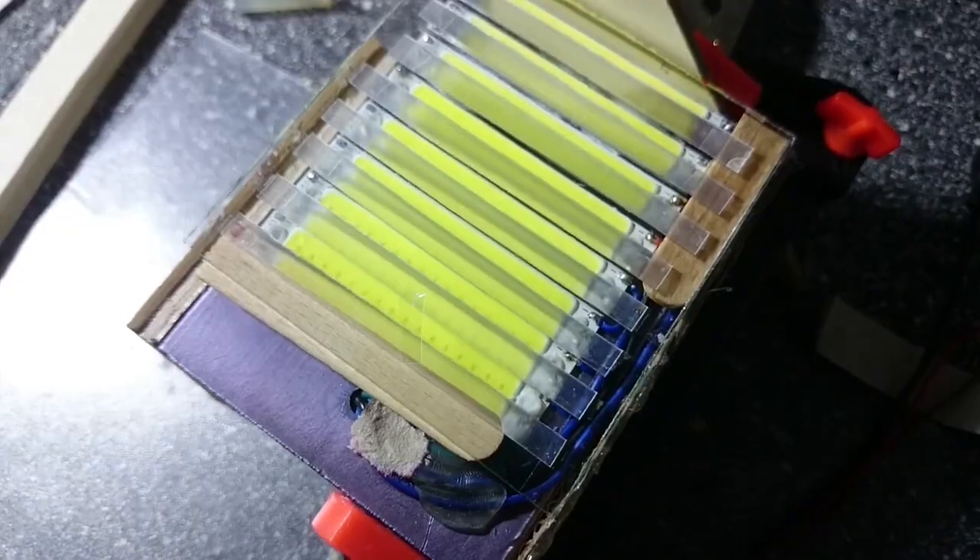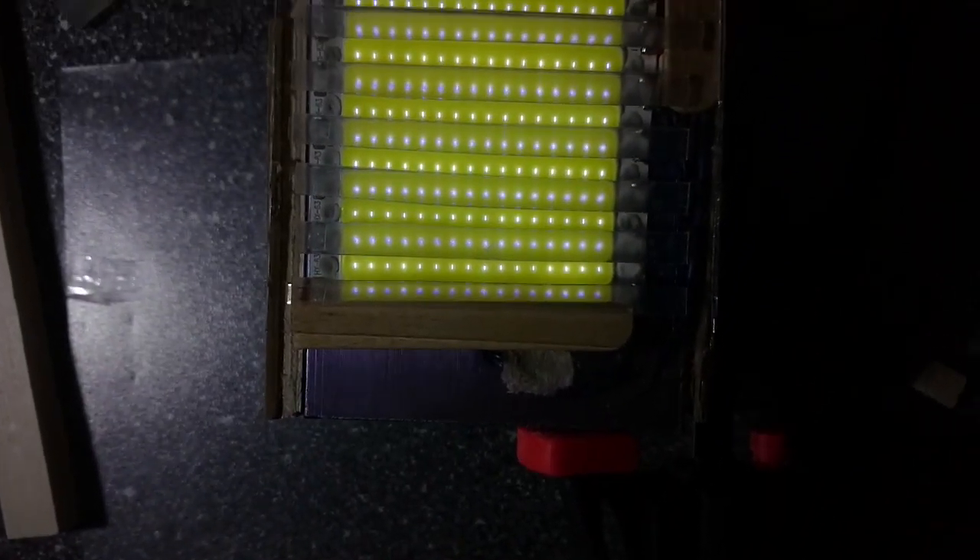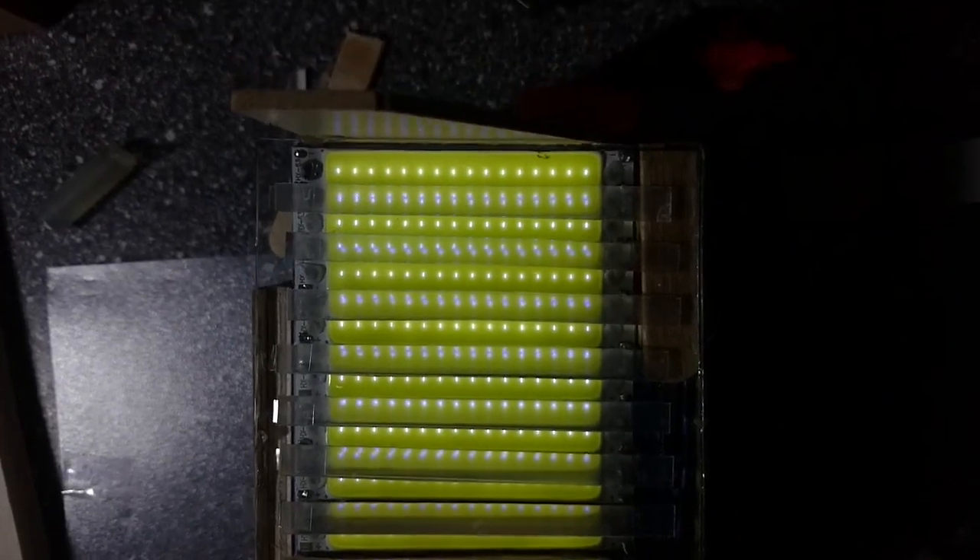I examined my lamp and found different things I could improve. I checked the light guide sheet carefully again and found something interesting: light that comes in at an angle is directed straight, which is good, but light that comes in straight is actually blocked and deflected heavily to the side, so a lot of light from my lamp doesn't arrive at the display. By cutting the sheet into stripes I can divert angled light straight while straight light goes through the gaps — basically doubling the intensity of the parallel light. A box around the lamp reflects slightly angled light back into the center. The modified lamp shines more evenly than the old setup and is also much brighter.